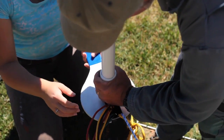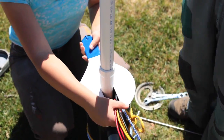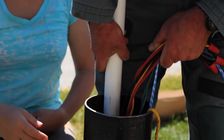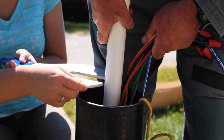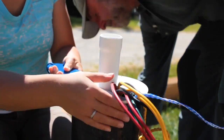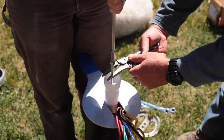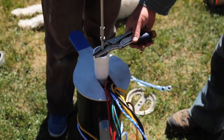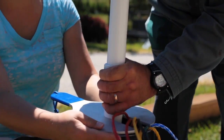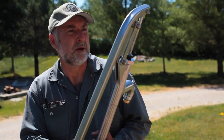There's no solvents involved and no need to use a wrench — hand tight is fine. There are lots of threads, and they come with Teflon tape already wrapped on them so they hold water very well. In my case, because the static water level is about 55 or 60 feet below the surface, I ended up putting on nine lengths of pipe total.